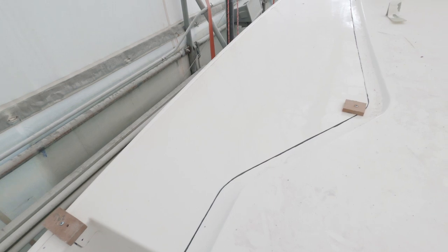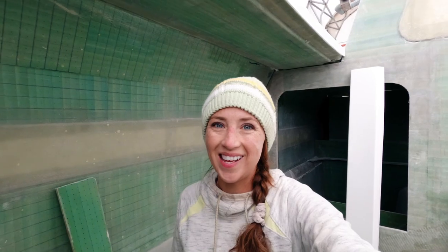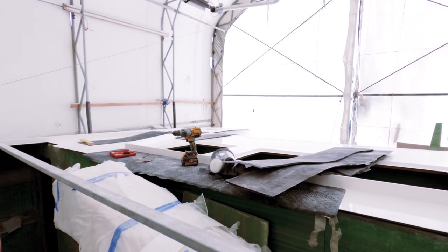The days are definitely cooling off and we're outside of that Goldilocks zone now where things were still warm enough to bond while keeping it cool enough for Matt and I to work all day. We're below normal temperatures in the low 50s, so we do have our heating lamps. One of the steps we're working on today is getting the upper parts of the bulkheads attached to the hull sides with just a little bit of thickened resin right now — we'll go back later and fill and glass those in. That sets the bulkheads in their final positions relative to the hull sides, which sets where the deck is going to be in its final position. After getting the foredeck piece in last night, we really know how it's all coming together. We'll get the heat lamps on these, let them sit for a few hours, and keep working towards next week when it warms up to the 60s and we can actually get these decks bonded down.